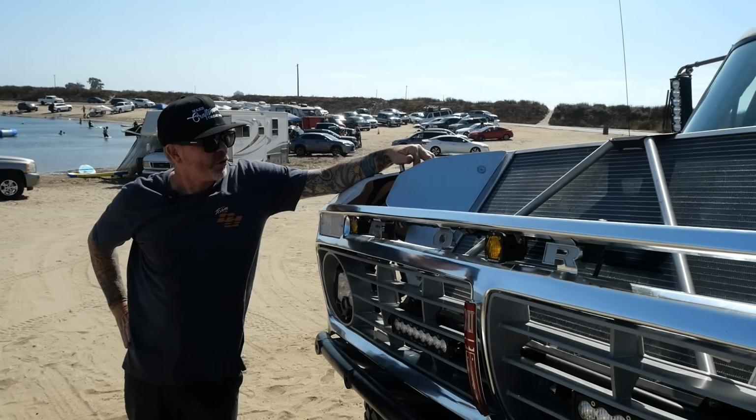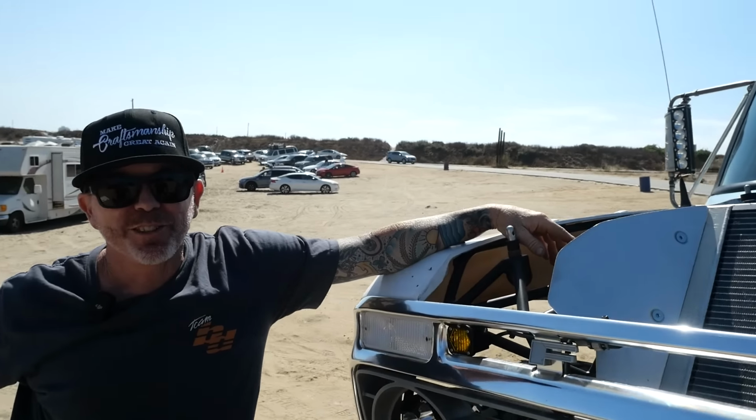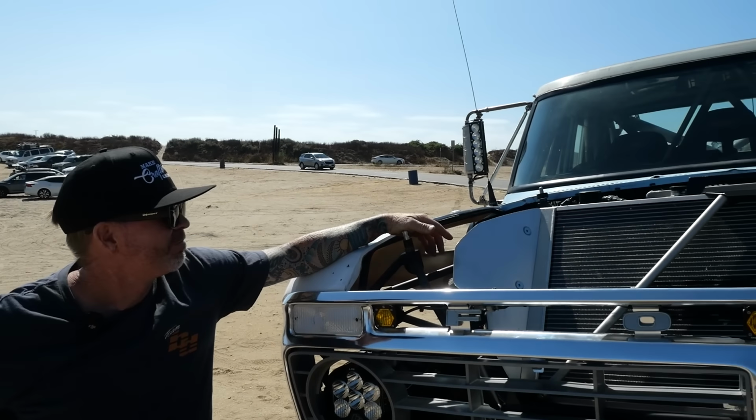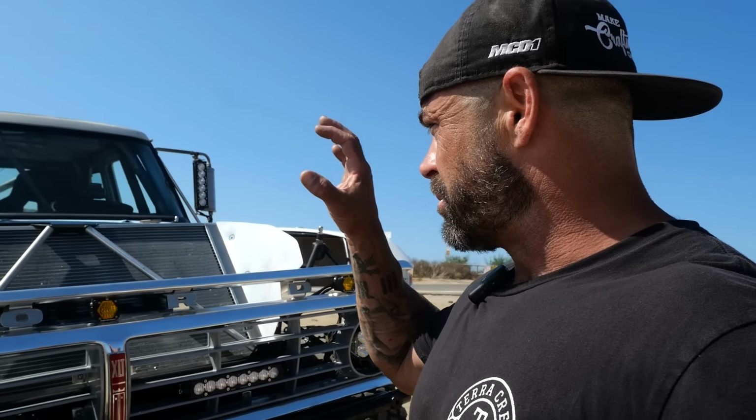There's a front, engine, interior, and back, so you could have a ton of lights on. Yeah, and it's really functionality. It's one of those things at night. I'm a firm believer in putting service lights everywhere you can, especially in the hot spots. We have them above, on all the suspension corners, all down the trans tunnel, everywhere where a shock is, everywhere on the inside motor area.